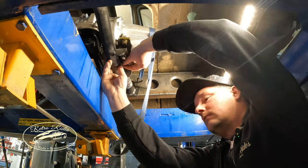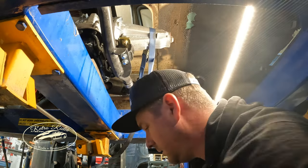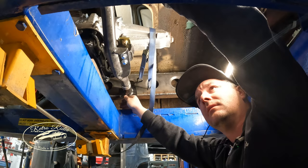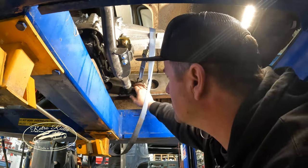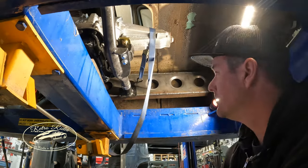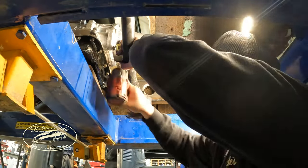Plus, with the dimple dies in the frame rail, I don't want them to sit in there all weird either. So, taking a look, seeing how they sit. Not really stoked on it. It's the end pieces, you can see they hang below the frame, and try rotating them sideways as well. Spinning the whole cross member around the other way.